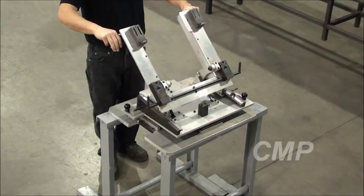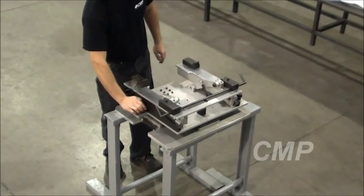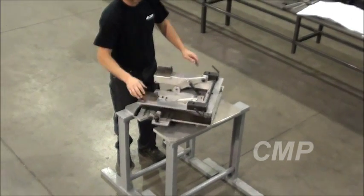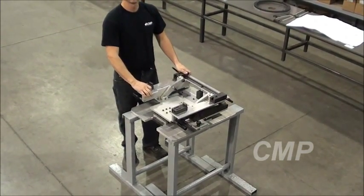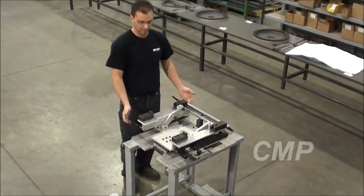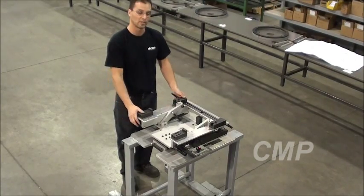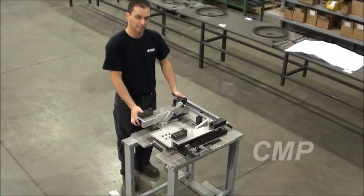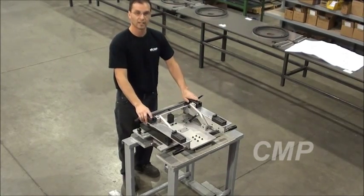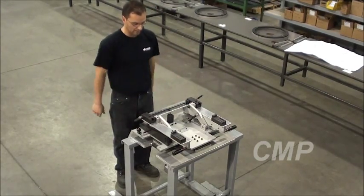You can work on it and also rotate it. You've got a rotate lock here — you disengage the rotate lock and it'll turn 90 degrees. At the 90-degree point it does a partial lock so you don't have to disengage the lock; you can just take the pallet and turn it. It gives enough resistance to work on the seat, and if you turn it 180 degrees it gives you a full lock again so you can work on the back of the seat.